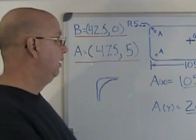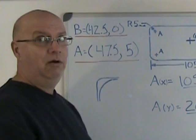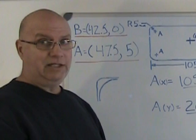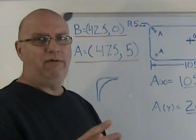Because obviously, if I cut all along my edge with a 0.5 millimeter tooth load on my tool, and all of a sudden I hit the corner and end up with a 4 or 5 millimeter thickness of cut, deflection is going to change and my accuracy will suffer. So, even though my 10 millimeter tool is a finishing tool, I'm going to be doing one roughing pass with it just to eat out those corners.